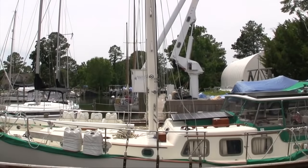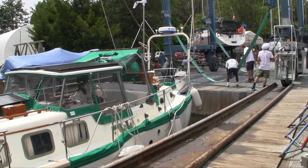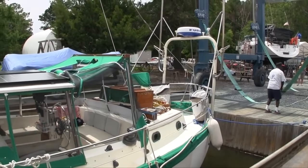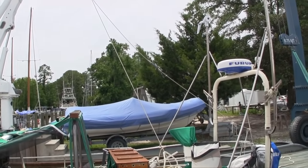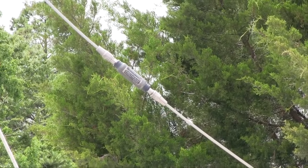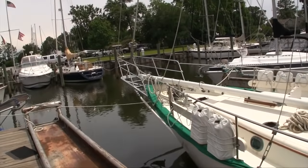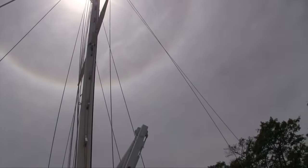It is so wonderful to have the mast back on the boat. We ran into some problems with the backstay. We replaced all of the standing rigging and came up a little bit short on the backstay when we replicated it. But it's not going to be that hard to fix because I've got an insulated backstay with Norseman fittings on each side. We just need to lengthen the wire underneath the insulator down to where it connects to the turnbuckle on the stern — about five or six feet of wire. So we've got a halyard tensioned on the stern to keep the mast up, and now we're about to haul out.